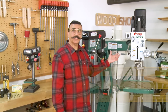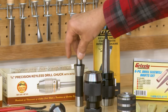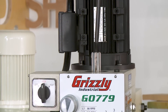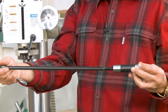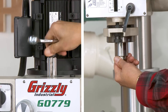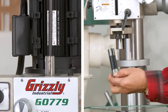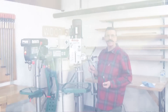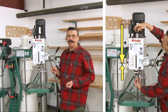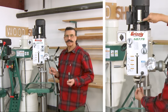Next, let's look at this larger industrial drill press — it has an R8 spindle taper on it. All R8 arbors have a threaded end on the back to accept a draw bar. The R8 taper is commonly used on milling machines and the draw bar keeps the arbor from falling out when applying side pressure when milling. R8 is also found on some larger drill presses like this one. There is a draw bar that goes through the spindle and snugs the arbor into the spindle. All you have to do is tighten the draw bar and the chuck gets drawn into the spindle — hence the name, draw bar.